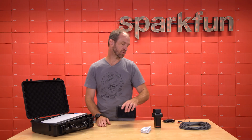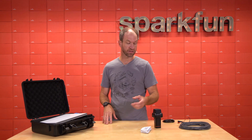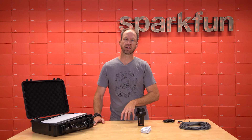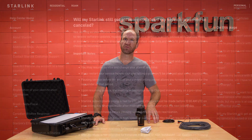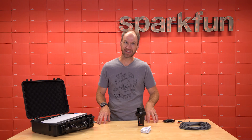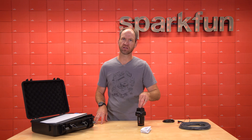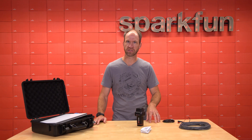Now let's talk about the service cost of using Starlink Roam in the field. If you're going to watch YouTube and hit the internet heavily, it's about $50 a month for 50 gigabytes. But for RTK service, we don't need 50 gigabytes — that's a ton of data. Starlink currently has an option to pause your service for $5 a month, and in the fine print you get 500 kilobits per second for messaging and safety connections. 500 kilobits per second is more than enough to handle NTRIP data — NTRIP uses only one to two kilobytes per second, and you've got 50 kilobytes per second available. It's more than enough.